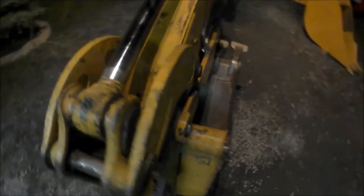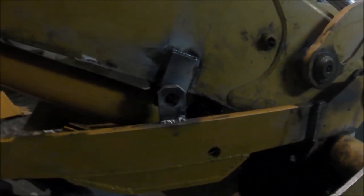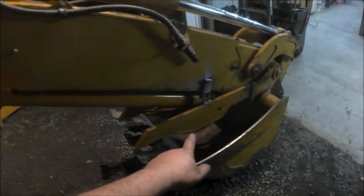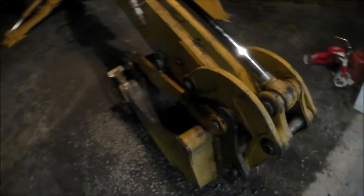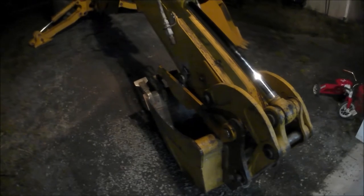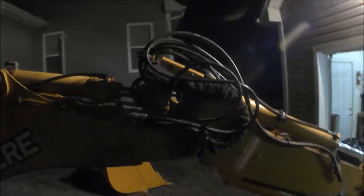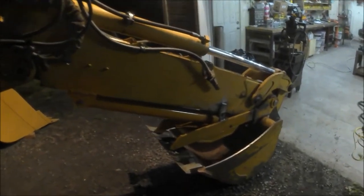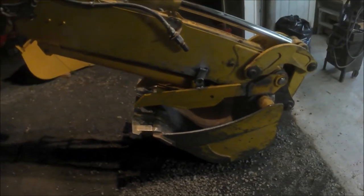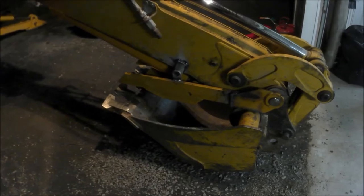I just finished the locking mechanism — I can put a one-inch steel bar through to lock it in place. If I lock the extend boom, the thumb operates; if I lock the thumb and unlock the extend boom, that one operates with the foot pedal. I still have to finish the cables tonight and give it a coat of paint. It's 11 o'clock at night and I've probably got three or four more hours. I figure I've put in about 90 hours of work on this thumb — and my wife is awesome for watching the kids for five days straight.